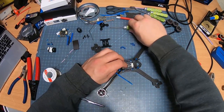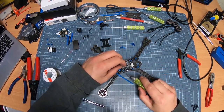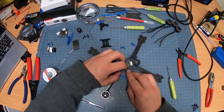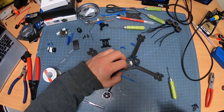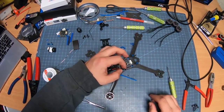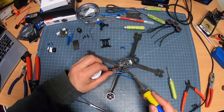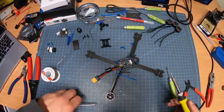Now, what I do with the small one here is I will take the wire and just make sure it's nice and tight there, and then I'll push it down. Now, we know center, you're going to go to center. This one looks like I might need to cut it slightly. So yeah, I'm going to do that. So I usually just go up to the board about where I want it there. Take that tip off, bring it out to the side. And again, pre-tin a little bit. Boom. Nice tip on there.